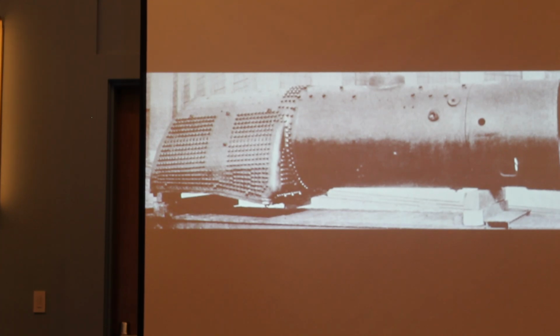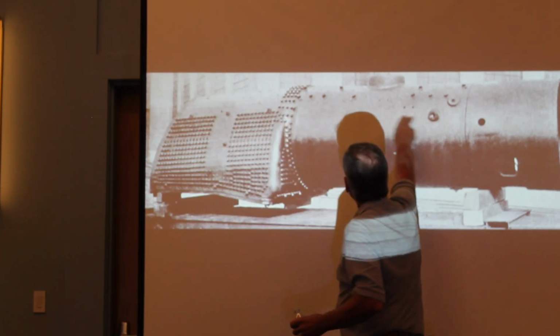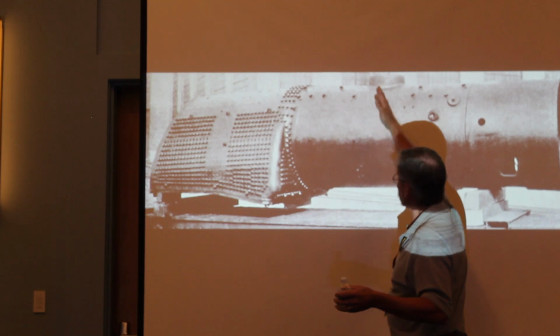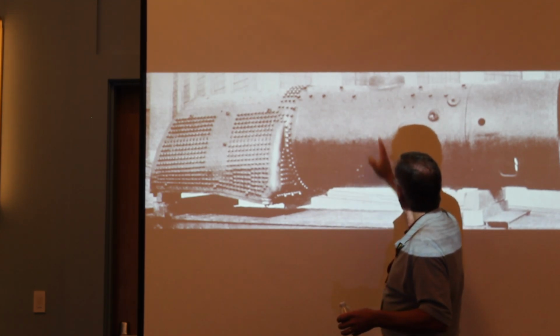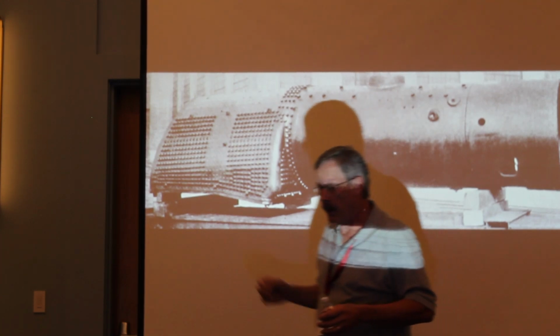Do they rate the welds as efficiency as well? Yes, and one of the holdups on welding boilers originally is if you weld this whole boiler together and you heat treat it, post-weld heat treat it, that's all well and good, but you had to take a penalty on all your joints, in particular where the longitudinal seams would be. This probably would have been 2 courses, and they just welded the 2 together. If it's riveted, there'd probably be a circumferential joint, right in here or right in here, either before or after the steam dome.